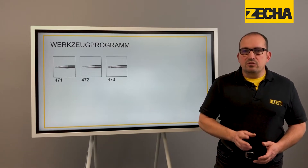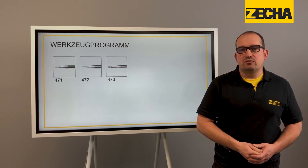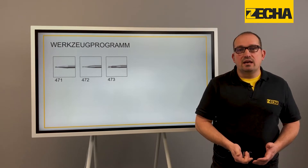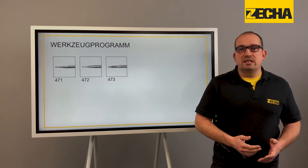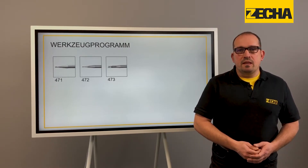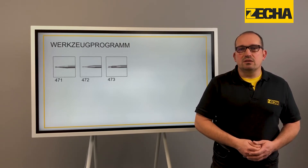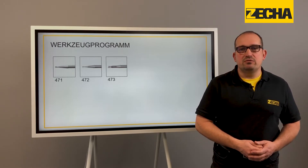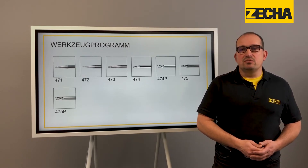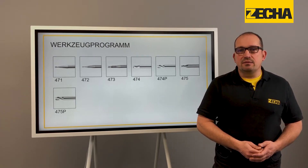Coated and with a 48-degree spiral and protective chamfer, the short version isn't only available up to T25, but also additionally with the tall diameters 1.0, 1.5 and 2mm for T30, T40, as well as for T45 and T50. The version in the 473 series with the long cutting edge is available from 0.2 to 0.8mm in diameter for T4 to T25.